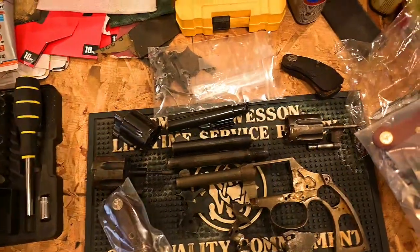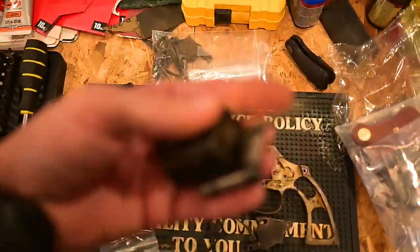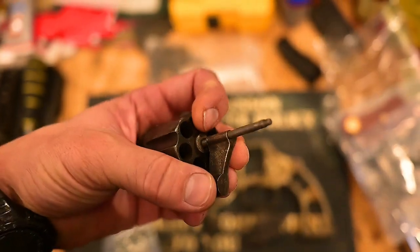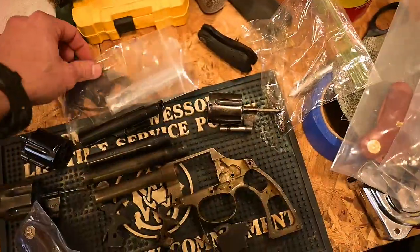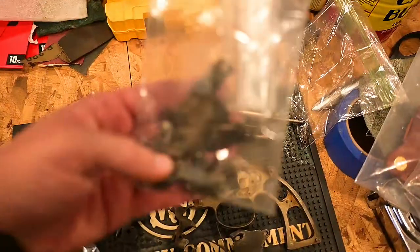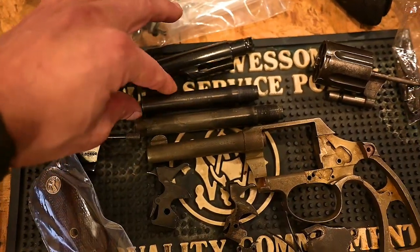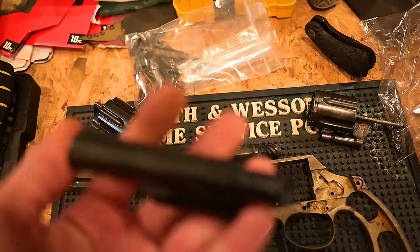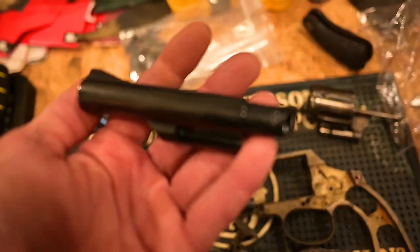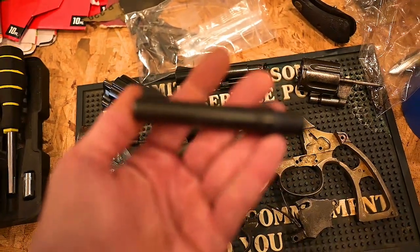What we're working with today is a Colt 38 Special Police Positive, and the cylinder crane is broke. He has a new one ordered along with some more parts. Somebody gave him extra barrels, but this is the only barrel that matches the original profile, thread pitch, and length. The forcing cone on another one would work, but it's a larger barrel so we're going with the original replacement.